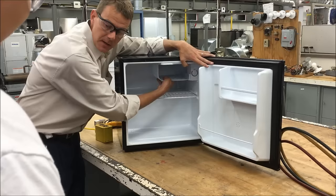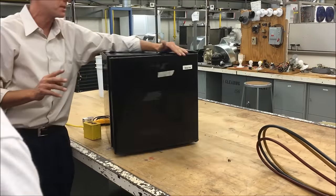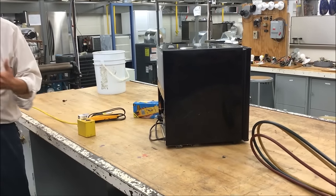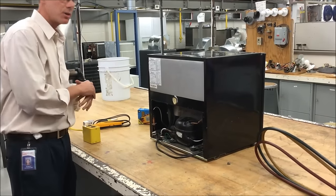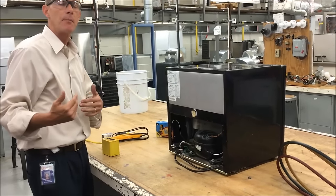This is where we should be feeling cold. Now, before you even know if you can plug it in — for example, somebody just dropped off this fridge, doesn't know what's wrong with it, just knows it wasn't cooling — you've got to do a few steps before you can safely plug it in. Because if it's something wrong electrically, which most of our HVAC refrigeration equipment, it's 80% of the time going to be an electrical problem.